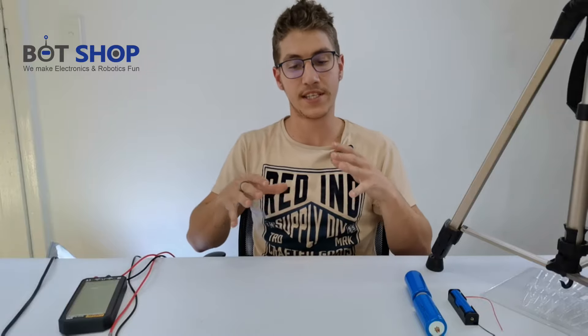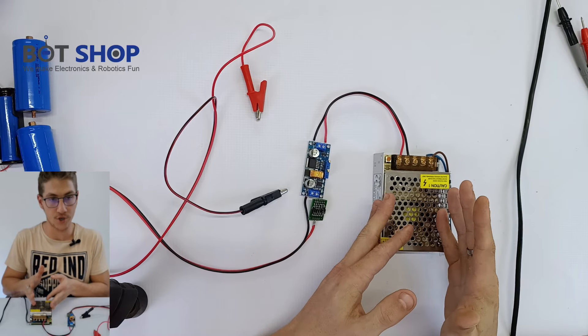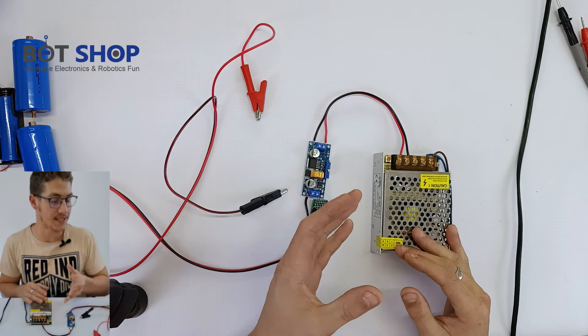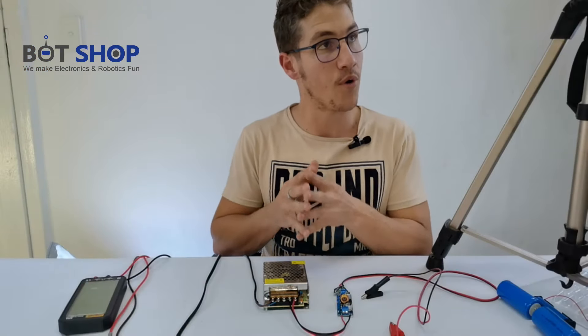So meaning, when we go back to our equations, each of these battery cells requires 3.65 volts to be 100% charged. If we add two of these cells in series, the new voltage at 100% charge is going to be 3.65 volts times 2, which equals 7.3 volts. This is the new charging voltage if there are two cells connected in series. Now let's get to the practical world where we're going to be charging cells based on these series or parallel connections.